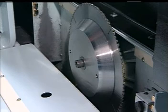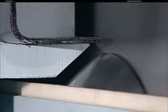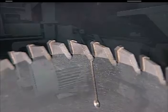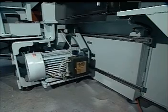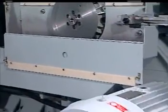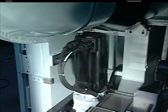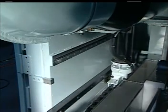The blade collar is another reason for precision. We've extended it to within five-eighths of an inch of the material being cut, so the blade stays steady and rigid during operation. The blade itself is carbide-tipped and travels below the tabletop to cut the material from underneath. The arbor is driven by a 30-horsepower motor, and the arbor bearings are preloaded and automatically tested at MetalSaw. With rigid steel carriageways for travel, the saw produces vertical and horizontal squareness within half of a thousandth per inch and two thousandths per inch, respectively.